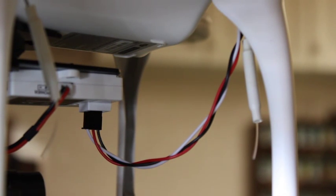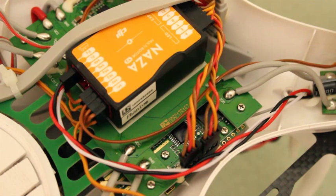You run the three leads parallel and then left over, right over — repeating that pattern — and that's the same whether you do three plaits, four plaits, five plaits, or fifty plaits. This is the routing of the long servo lead up through the rubber plug and then around the back of the other leads and into the F1 servo connection. If you have a really long lead you can just put a lot more plaits in it, which also allows you to shorten it, and the more plaits you have, the stiffer it becomes as well.